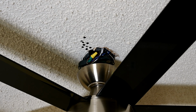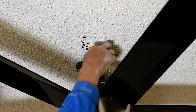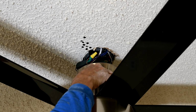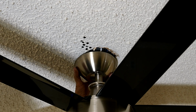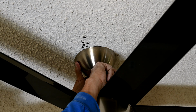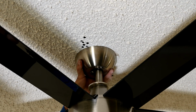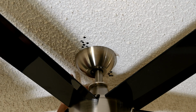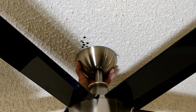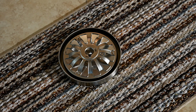Okay, now as we finish the wiring on the ceiling fan, I've shoved all of the other wiring nuts up here. This one I couldn't get in there because it just has to be right there. That's the only place I can get it to fit. Then what you do is you raise up your canopy and make sure it covers everything. And you're looking for the screw that's right here on the bottom of the mounting bracket that's sticking out right there. And see how it latches onto the screw there now? Now you've got it in place there, and then there's a screw that goes in on the other side. You twist it back around here till you find the hole where it's supposed to go, and you screw it in.